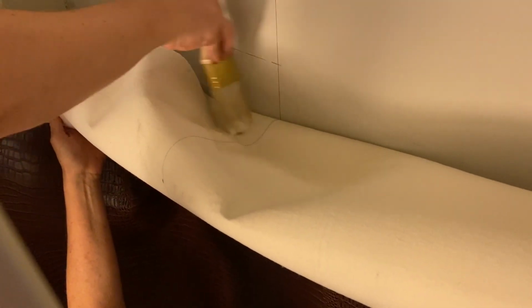Additionally, I applied a lot in the center when we were first hanging it to be sure that it stuck, and then when we got working toward the outside, we were rapidly running out of glue, which for the most part was not a big deal because we put up those moldings on the side to hold it in. However, there are a couple places where if there's not some glue behind, the faux leather kind of wants to bubble out away from the wall a little bit, which is quite noticeable if your faux leather has any kind of sheen, which many of them do. So there's some places where it's not totally perfect. If I get bored and crazy down the line and feel like it really needs to be fixed, there's potential to get a syringe and syringe in some glue and then press that flat. Definitely an option if you end up with some places where it's pulling away from the wall. But for right now, it's totally good for what I need.